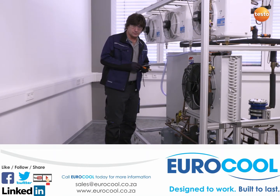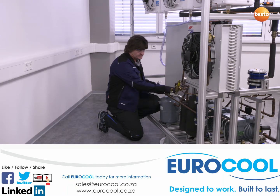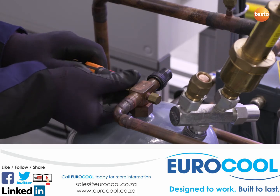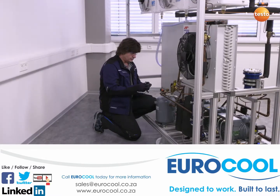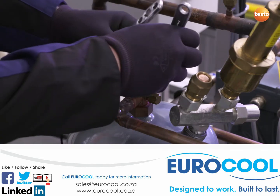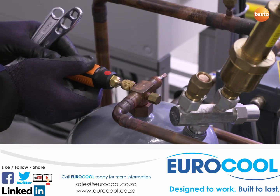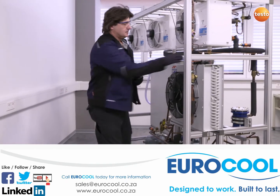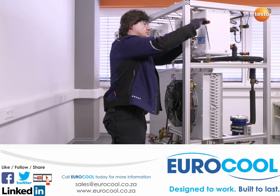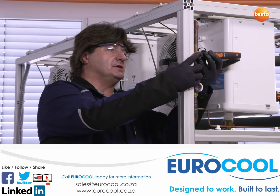At the same time, I'd like to check the subcooling in the system before the expansion valve. To do this, I will now connect the pressure sensor to the high pressure side — in this case, to the refrigerant collector. I will now open the angle valve and establish a connection between the container pressure and the pressure sensor, and at the same time activate transfer by Bluetooth. The second measurement is my temperature reading, in this case on the common liquid line at the top here. I will connect the temperature probe directly to the liquid line before the expansion valve, check that it is in the right position and switch it on.